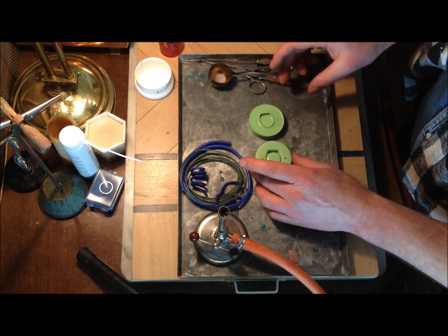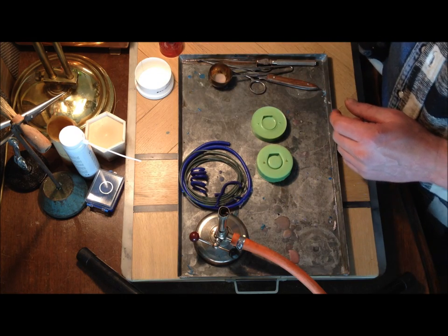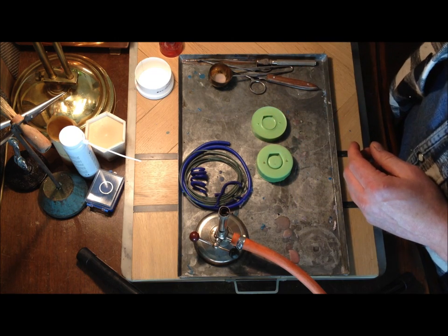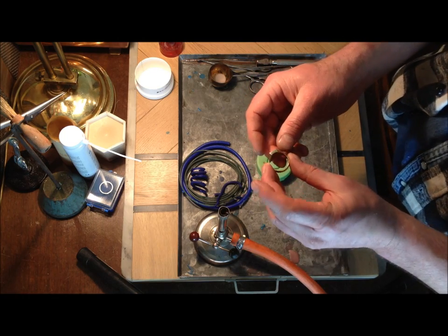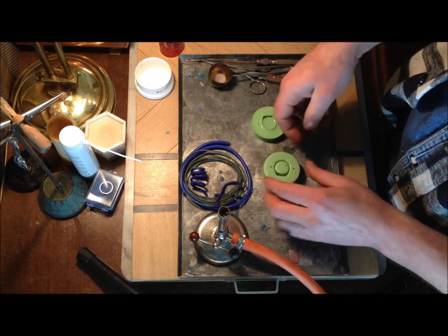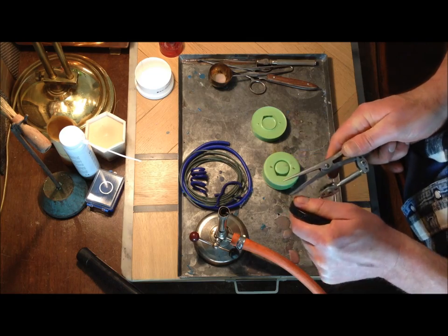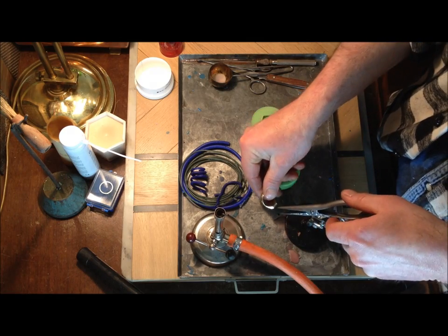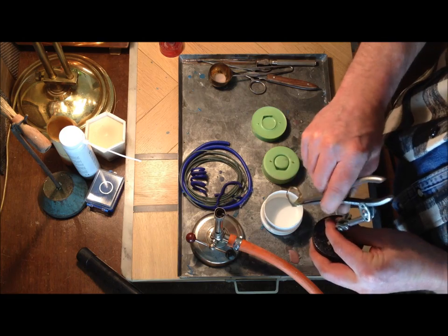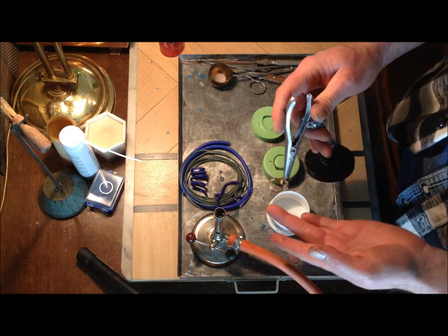Now I've gone a step farther and I've made a two-piece mold. Instead of just using the simple one we had before in the film canister where it was on the surface, we're now dealing with a ring that has more dimensions, so you can't just lay it on the bottom of a can. In this case what I did is I poured half of the form first while suspending the ring with a bit of help. So let's just suspend it in there.